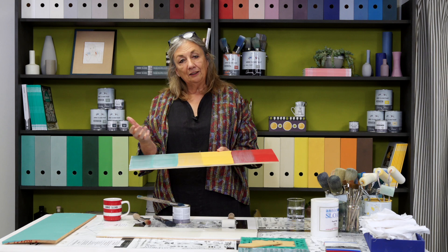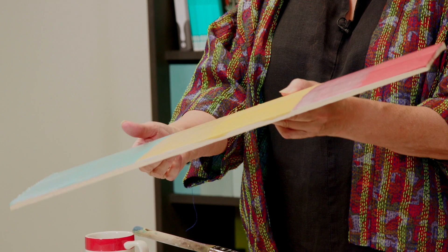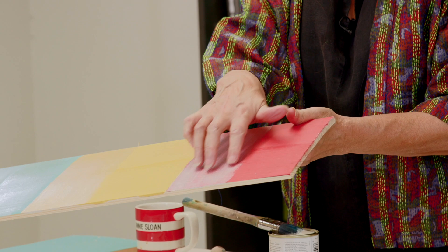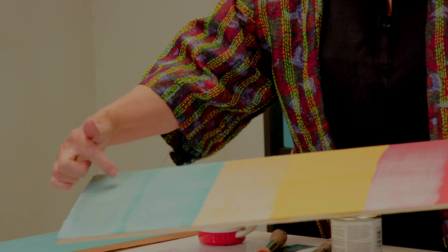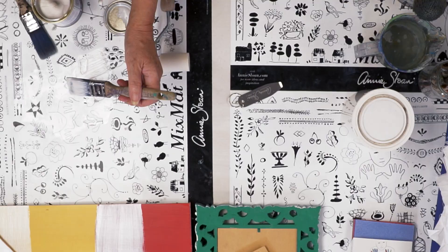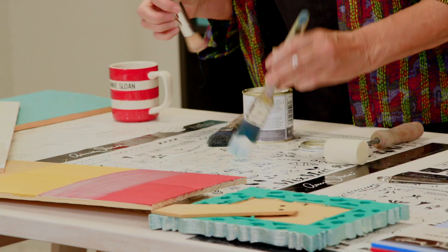It's got this beautiful glaze which catches the light. One thing you might have noticed is that the brush marks show — we've done that deliberately. If you don't want that, apply it with a roller, so that one has brush mark stripes and this one is done with a roller. For smaller areas you might use a stippling brush and apply it like that.